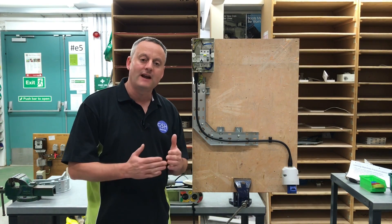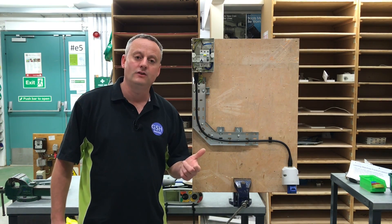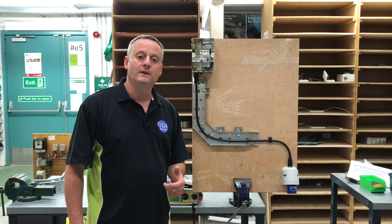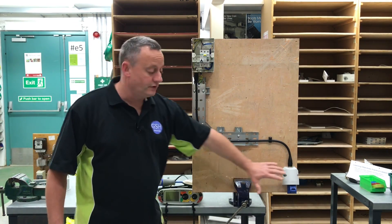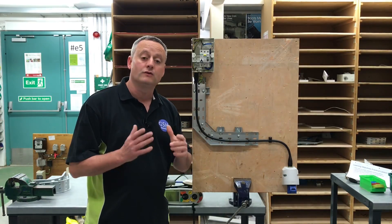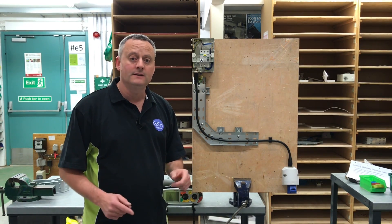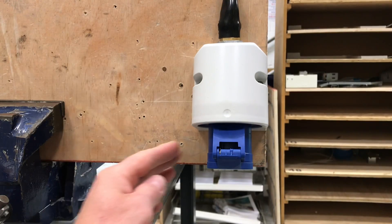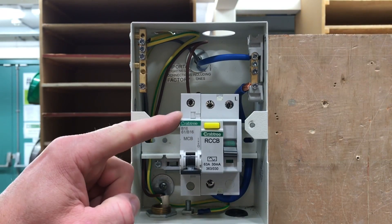In this video presentation we're going to look at carrying out the continuity of CPC. We include the polarity test and then follow it with the insulation resistance test of this circuit here - a circuit with a mimic to help us with our City & Guilds 5357 practical assessment. We have a consumer unit and an industrial socket outlet fed between them with a steel wire armoured cable. After installing our system we're expected to carry out the dead tests. Note that we've got a 16 amp industrial socket outlet, therefore the fuse within the consumer unit also needs to be 16 amps.